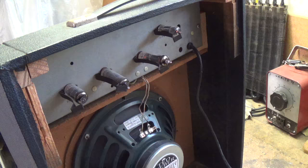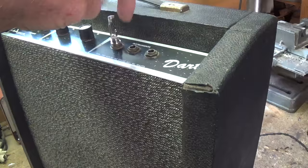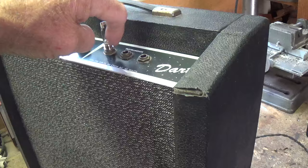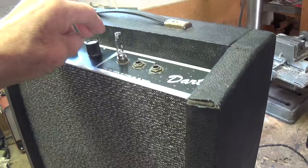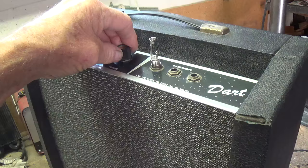Let's see if it can take any sort of input. I cranked up the volume a little bit and put in a jack. I'm going to touch the input prong — I don't hear any hum in response to my touching this, so it's accepting no input. I'm thinking there's some serious problems with the power supply to produce this 60-cycle hum. You might think the power supply should hum at 120 cycles — let's see why that's not true in this case.